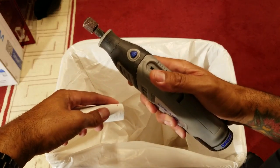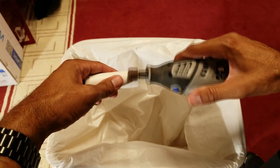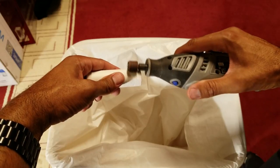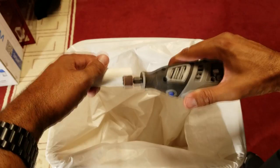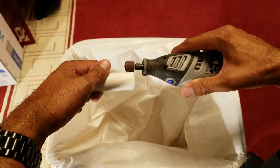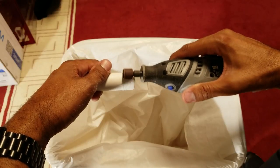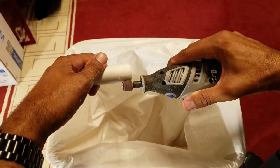To get my hose barb to properly seat into the coupling, I used the sanding head on my Dremel tool. You can use some sandpaper to accomplish the same goal, it'll just take a little bit longer. I chose to sand down the hose barb rather than sanding down the coupling in case I messed up. I have easier access to more hose barbs, whereas if I messed up the coupling, I'd have to reorder another one from EcoTech and wait for it to arrive.